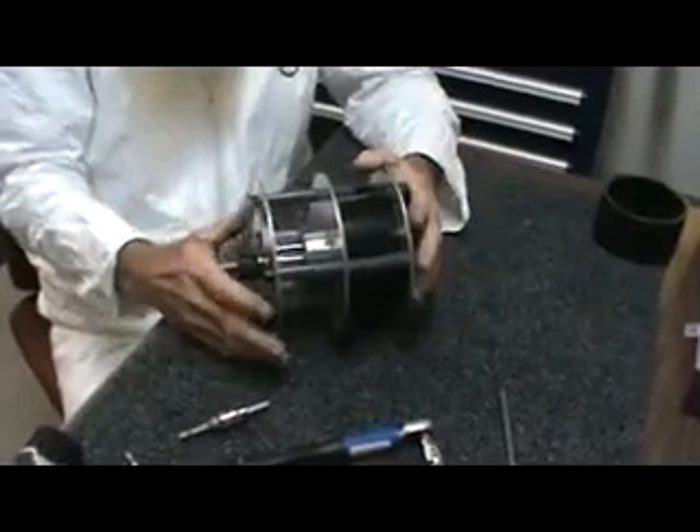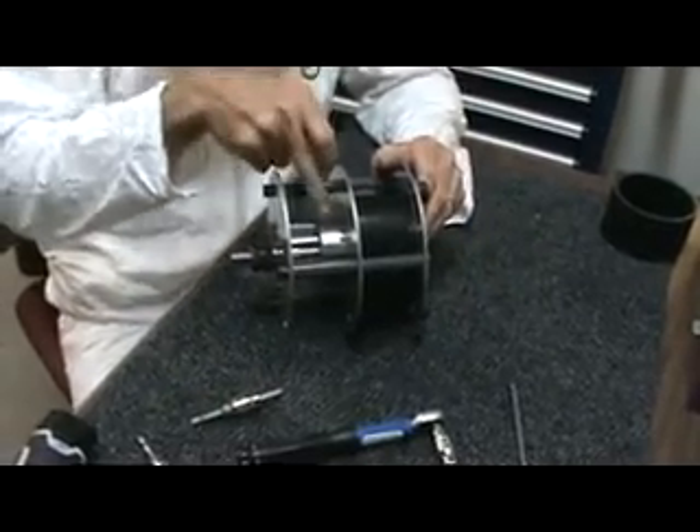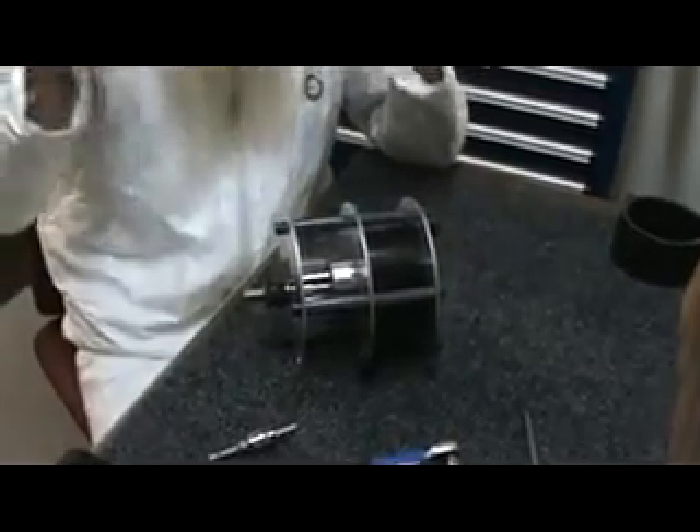In this situation, I far prefer to take the whole grinder approach — to look at the entire grinder as a whole rather than simply focusing on the burr. It can throw you off. You can literally chase amazing perfection on the burr to the extent that you're chasing artifacts, if you don't have the two bearings aligned properly.